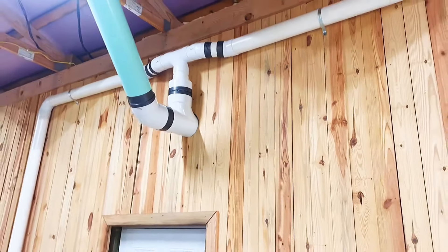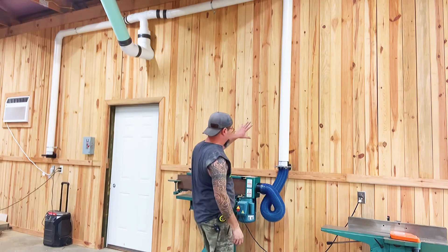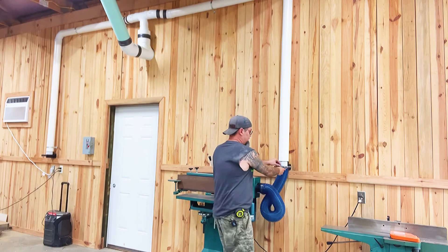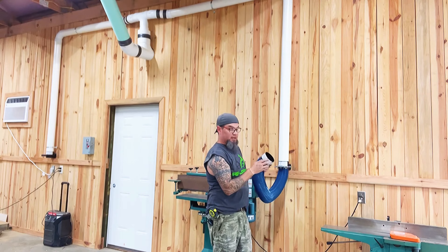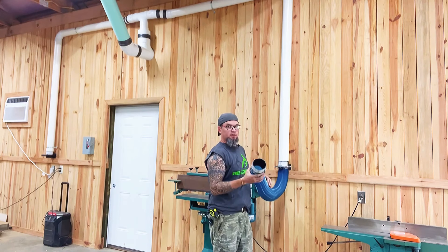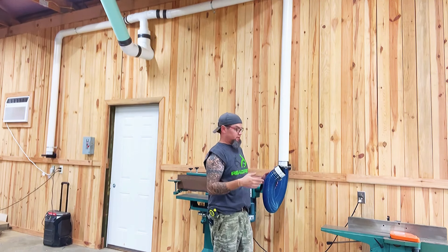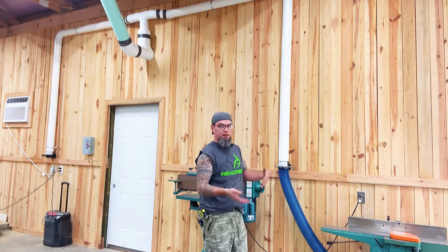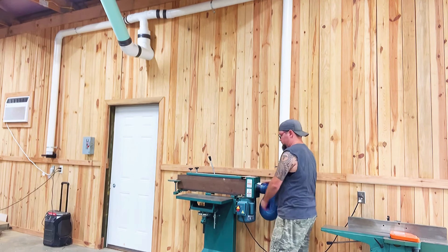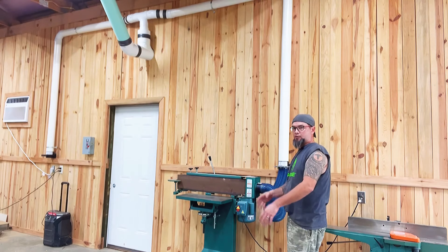It breaks off into two branches, reduces to four, and drops down to two blast gates. For the right leg of my trunk line drop down, I have it going to a dedicated blast gate, and then I have one of these Rockler adapters that I was telling you about — get plenty of them. They work perfect for interchanging between two pieces of equipment, so I don't actually have to have two drops. Every drop you have is going to decrease your suction. I can just use this one, hook it up to my jointer or hook it up to my sander. I put the sander on a mobile base so I can move it around and I'll have plenty of flex line to move it out and use it if needed.